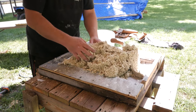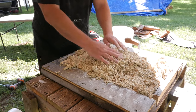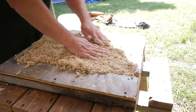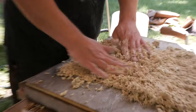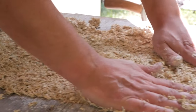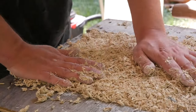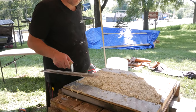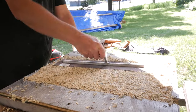Everything's been mixed very thoroughly — see, it's packing — and then we're just going to stick it in the mold. Fill in all the voids, look for the low spots, really push it in. You want to make sure there's no air pockets, no voids. I'm pushing it in nice and tight. You can see there's almost the exact amount, so I put all the hempcrete we mixed right into the mold on top of the bottom plate, and now I'm going to start packing it.